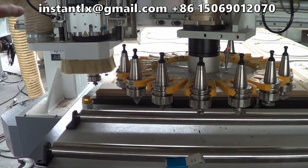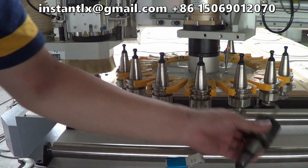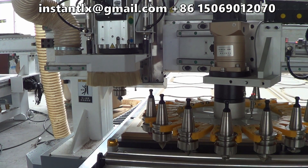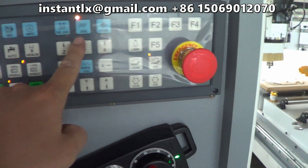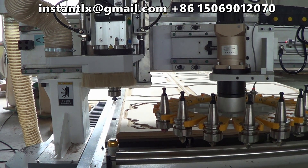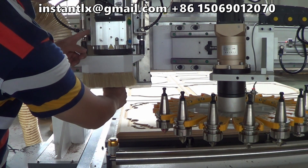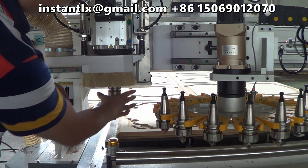You see the spindle is holding T1 — make sure the T1 seat is empty. If you put another one into a wrong position to T1, when it's changing tools something will be damaged, and you won't want that to happen. When the machine is on and you set the panel to manual mode, jog is enabled and we can take off the holder manually — hold it and press this button so it's off. If you want to insert it again, hold it and press it again, and it's tight again.